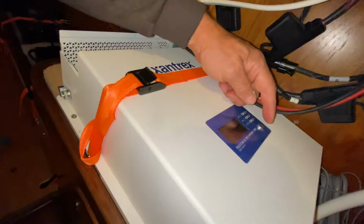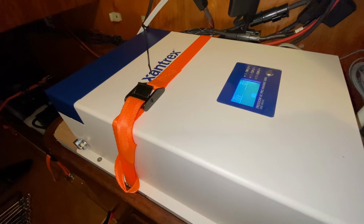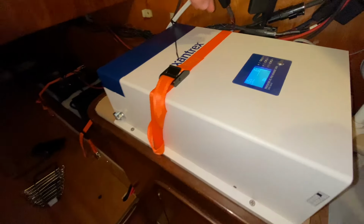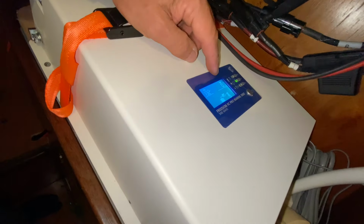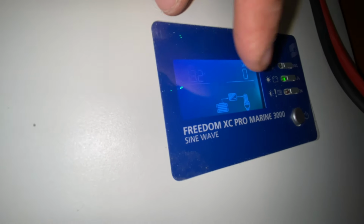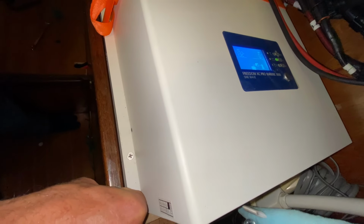I think to turn it on, it's a push button. Right. And that's normal, those fans. I think so. I think it's just starting up, blowing everything out. And then this came on automatically. Volts, that's your batteries. You've got no load, so we've turned it all off. You've got your battery, your inverter charger there. It's going DC to AC, and that's your load symbol there, which is a fluoro lamp. Okay, pretty straightforward.